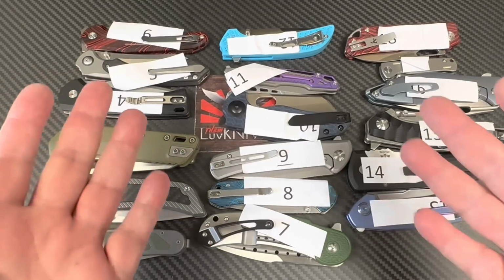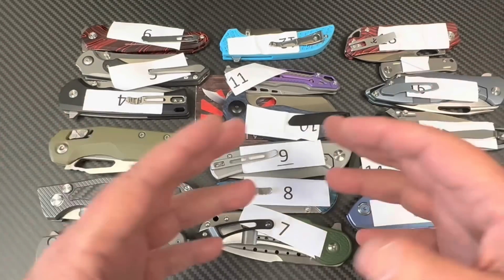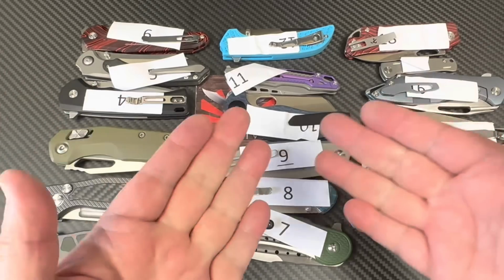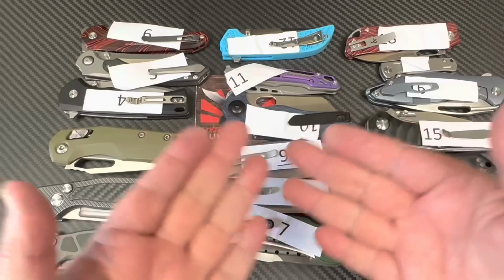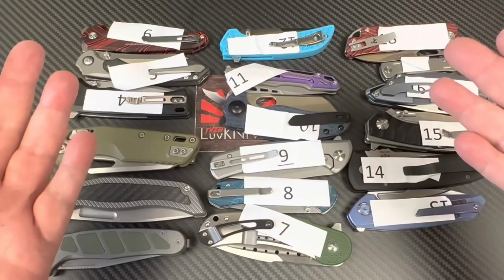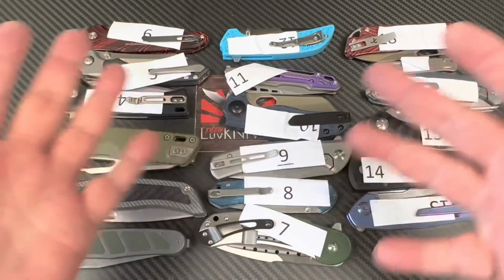58.7. All I can say is I think that Microtech's doing their heat treat in an intentional fashion. They're going for toughness over edge retention. That's what they're doing. The lower the Rockwell like that, the easier it will be to sharpen, the more toughness you'll have in it, this and that, but is M390 more of a Ferrari and edge retention machine if it's at a 62? Yeah, so